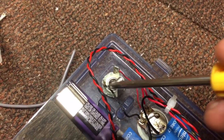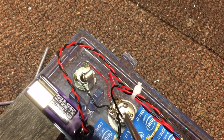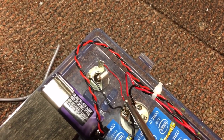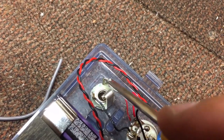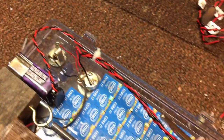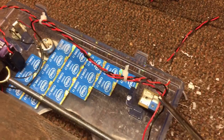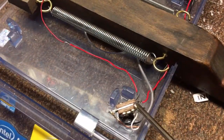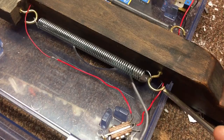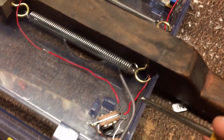Starting with the jack, you can see the grounding side here is to the left tab, and everything is grounded to the back of the chassis of the potentiometer. The middle tab of this potentiometer is what feeds the hot side of the jack. The input of this potentiometer is the output side of the psycho knob. The input side of the psycho knob comes from the switch output. The center two tabs here are the output of the switch and I drilled a little hole in the neck to route the wires back and forth, and there is also a ground wire that grounds this side too.